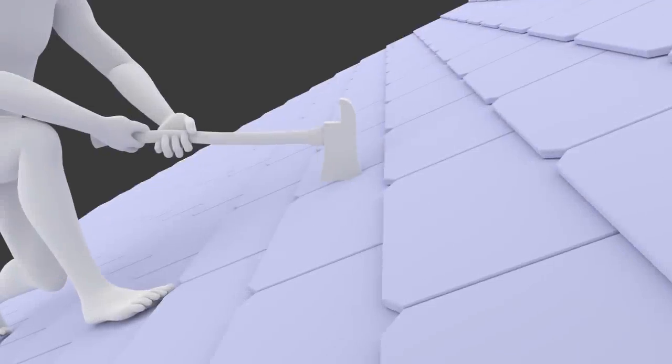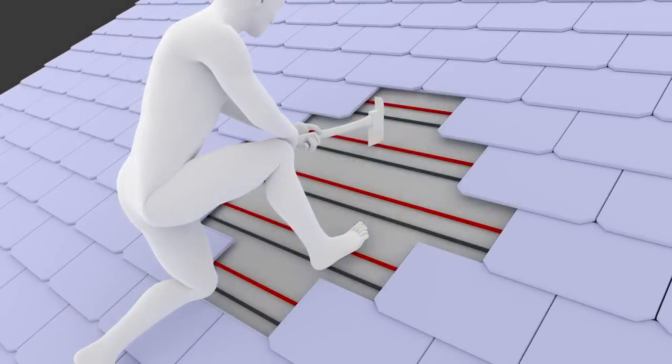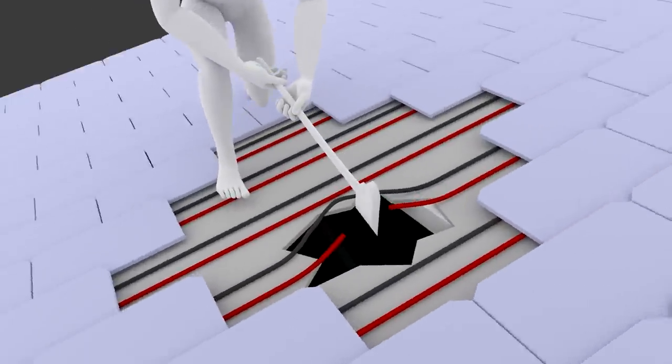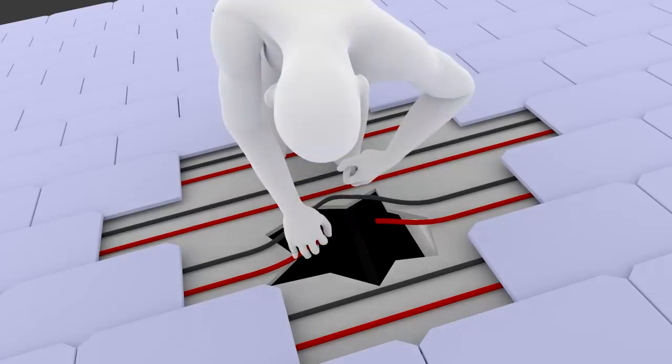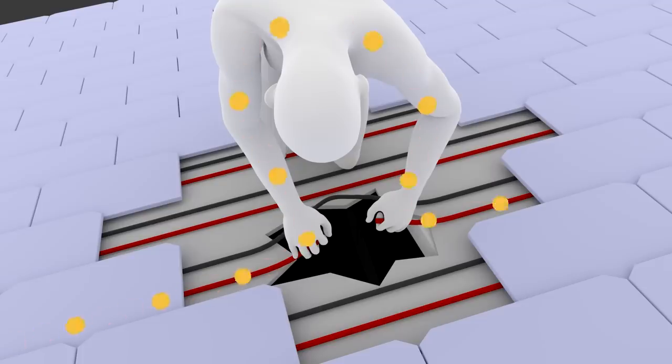In this example, we will use the Tesla solar roof. In this circuit, power is being produced by the solar tiles, and it travels to the inverter mounted below. If the path is interrupted — say by a firefighter cutting into the wire — the electricity will no longer flow. If the firefighter then touches one side of the cut circuit, he will not receive a shock because the circuit is not earth-grounded. However, if he was to somehow come in contact with both sides of the cut wire, there is potential for shock, especially with ungloved hands. It should be noted that in this DC circuit, cutting the wire does not present a risk to the firefighter because they would not be the path of least resistance for the current to flow.